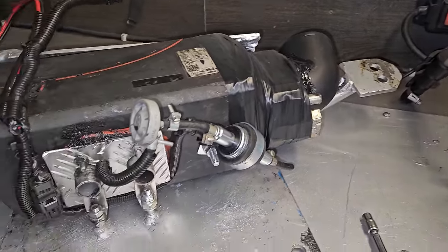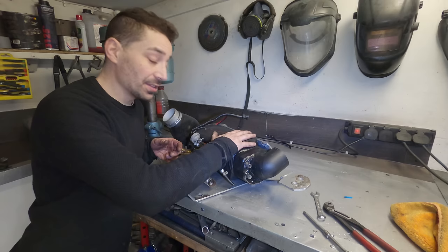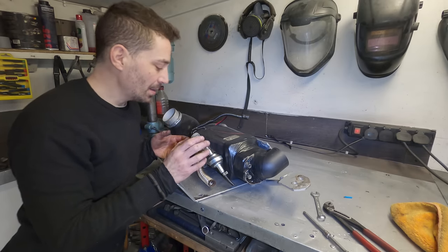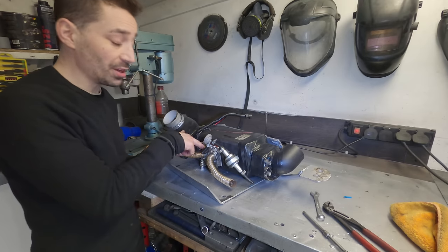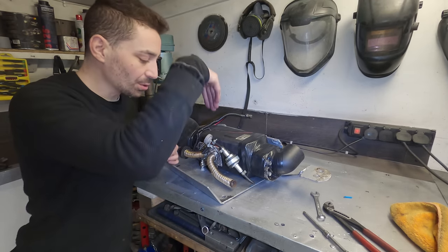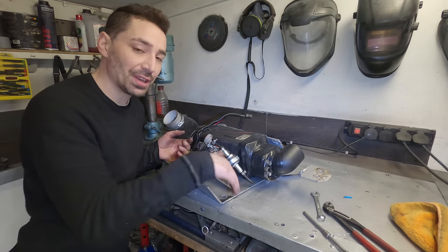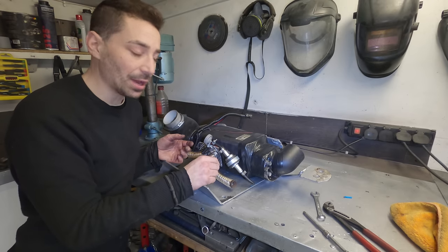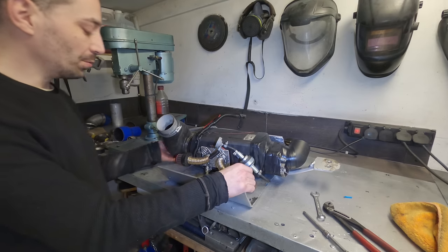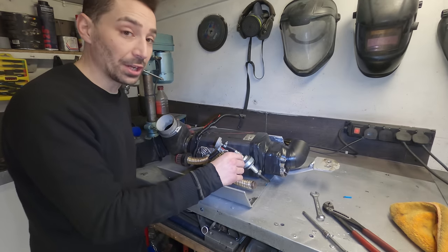The OCD has almost been satisfied. I really couldn't leave it the way it was because from a maintenance perspective it was just too difficult. If I wanted to get to the diesel heater just to change a glow plug, I'd have to take the skid plate off and unthread all the hosing. The orientation wasn't how I wanted it because the fuel line has to be at the top if the heater's on its side — that's why you saw it orientated the other way before, because that was the only way the exhaust would face the back. I didn't want the intake and exhaust facing down; there isn't enough space. Now you can just loosen those two bolts, two nuts, and the whole unit pops off so you can change your glow plugs. It's just all one thing.